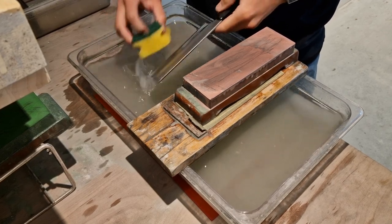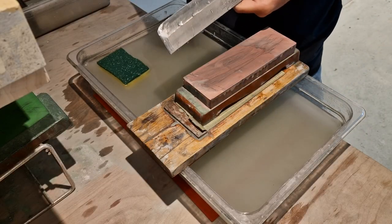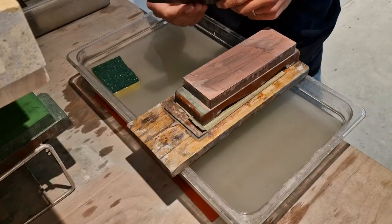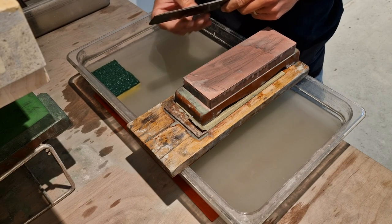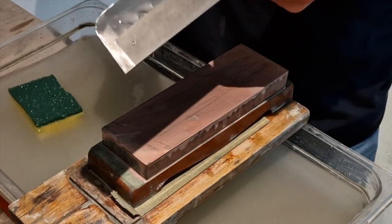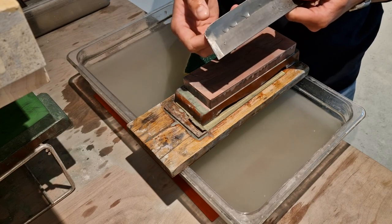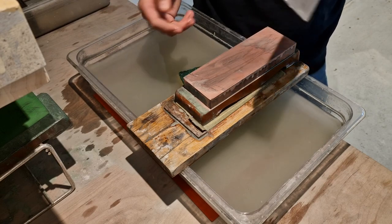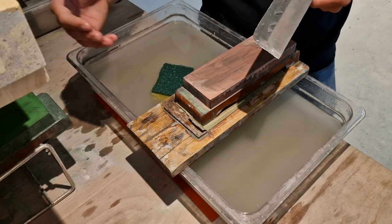Light pressure, no need to press really hard. Now it's more difficult to check your progression because it's harder to see scratches and where you've been. Also, because you had a burr already, there won't be any obvious checking if there's a burr again — that's why people are also tempted to remove burrs on a thousand stone with single bevel, but I wouldn't do that. You just have to be consistent and check your edge. With a three thousand stone you're not removing as much metal as a thousand stone, so you can go over the knife a couple more times just to be safe and remove the scratches of the thousand.